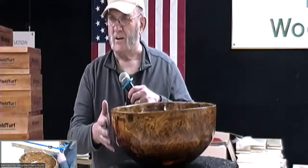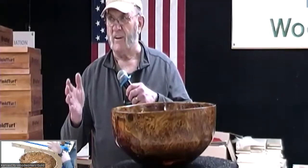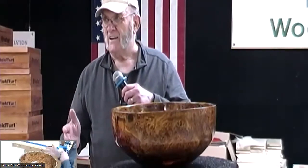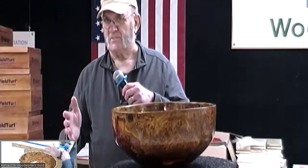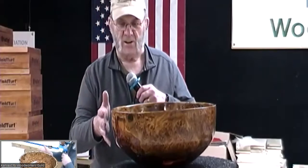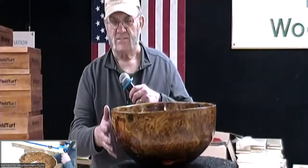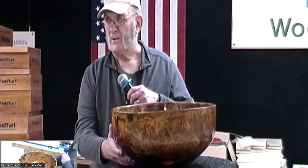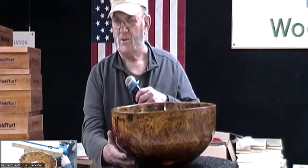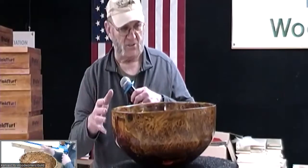You want to be careful when you start thinking about using resins, because if you have a fast setting resin, it's going to heat up quick. So you want a penetrating resin, like a slow setting resin, meaning it's going to take a day to cure. I used TotalBoat penetrating resin on the first bottom part of this because it had the most nooks and crannies in it.